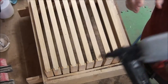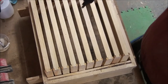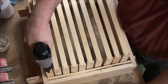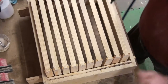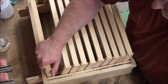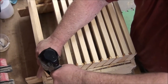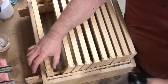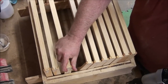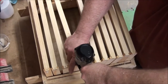Your gun is probably similar to this one — it's got that little thing you have to push on your work to make it fire. The problem is if you're right-handed you can't get right to the edge on the bottoms to glue it and push it down, so I need to do this left-handed. This takes a lot of finger strength. I pull the joint tight with my thumb and forefinger and then push down with the gun just before I pull the trigger. You can tap it with your mallet if you want — try to get that joint tight.